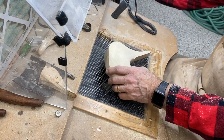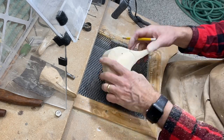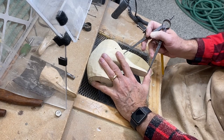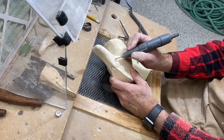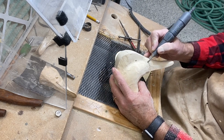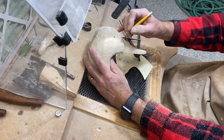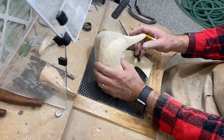Now that things are generally rounded, I want to begin to define where the bill should be — the upper portions of the bill — so I'm sketching in where I think they should be. Using the dividers, another key dimension is from the tip of the bill to the top where it meets the face, and it looks like I'm pretty close. I'm using that small 3.5 mm ruby bit to define those lines and carve them in a little bit, creating some separation between the head and the bill. It's really important on a canvasback that we don't lose that nice slant profile, so I'm penciling in the bill to get a look at it and make sure I'm happy with the way it looks.